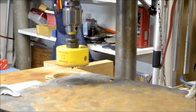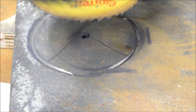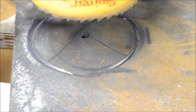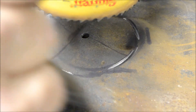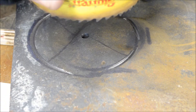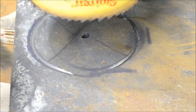I'm going to bring it a little closer here to show you what we've got going on. It's a textured cut that we're making — it's an interrupted cut because of the texture of the cast iron. We've got high spots and low spots, and I don't think there's going to be a point where we're going to have a true continuous cut. I think by the time we get through the high spot we won't be touching the low spot yet. The hole saw is still relatively cool — I can touch it — so I'm going to keep an eye on that. If it starts to get hot I'm going to have to slow down or cool the hole saw a bit. We've got a good chunk of it taken out already, so let's keep going.